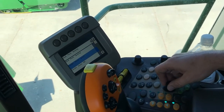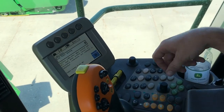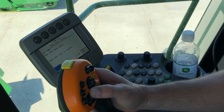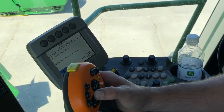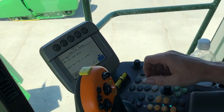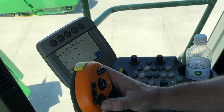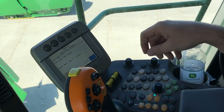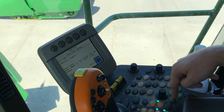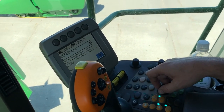The first one on the list is deck plate spacing. If we use our check mark and hit deck plate spacing, it says the requirement is engine running at low idle. We'll hit save and enter. It's going to ask us to fully close the deck plates. They are fully closed on the corn head, so we'll scroll over and hit the next button. It wants us to fully open the deck plates. They are fully open now, so we'll hit the check mark again and the calibration is complete. On the 70 series, we want to make sure to save our calibrations by hitting the save and enter button, and it brings us back to our calibrations page. That was our deck plate spacing calibration.